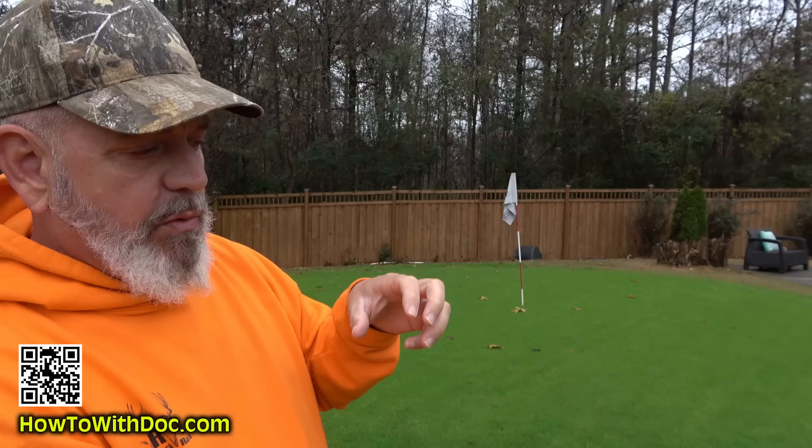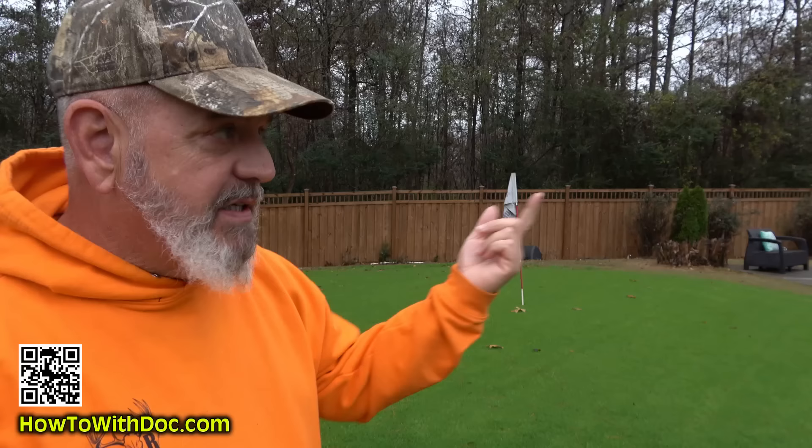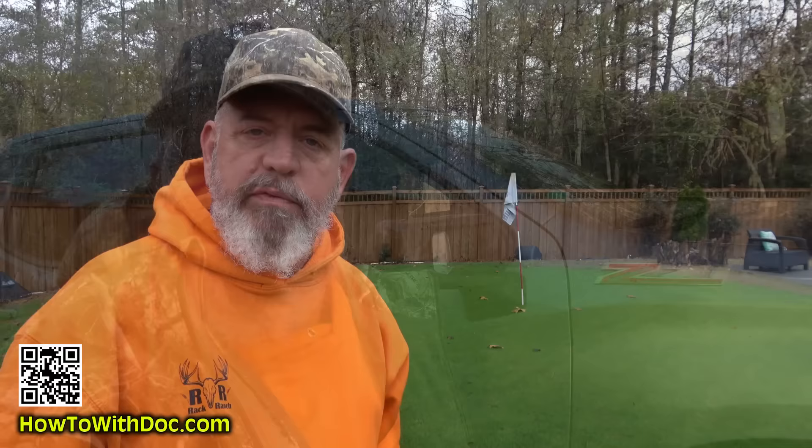There's actually a YouTube video where a guy tested this process — he pulled one of his fence posts out after setting it with water-in-bottom, pour-concrete, water-on-top, and it was rock solid a week later. That method works fine here because we're not supporting a huge amount of weight. On the heavy privacy fence, those posts went 36 inches down with cement. On these fence posts we're only going 24 inches down — cementing at that depth will hold it just perfectly.